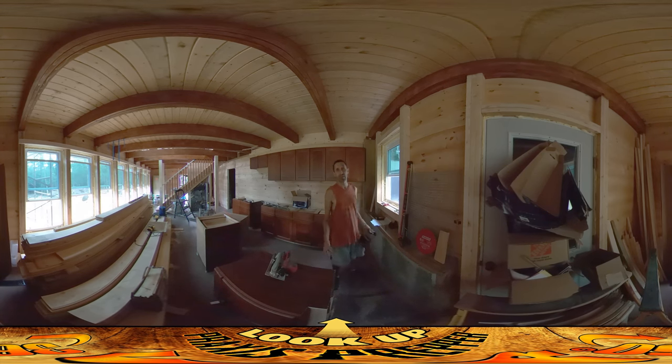The floor here is not flat. You could say 'what terrible contractors to have poured the floor,' but it's actually kind of ordinary that a concrete floor isn't going to be absolutely flat everywhere — that's just the nature of it. So I'm dealing with it by reshaping the bottom of this cabinet that's going to sit right up here, so that it will fit onto the floor without rocking around.